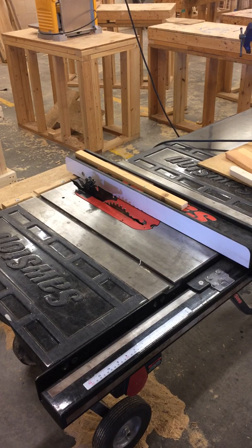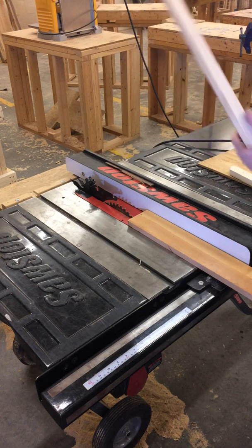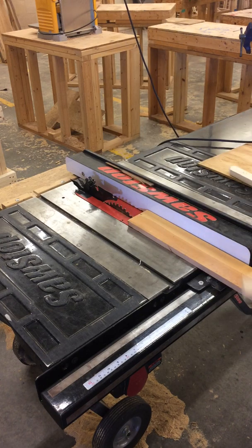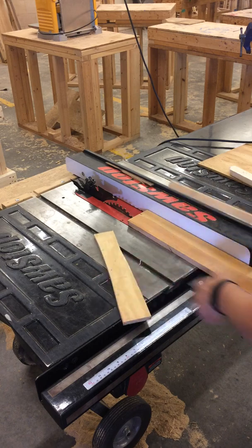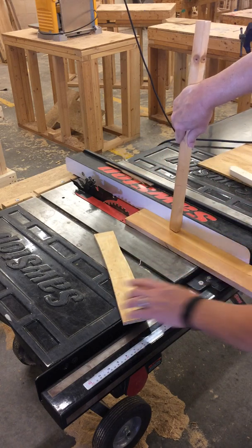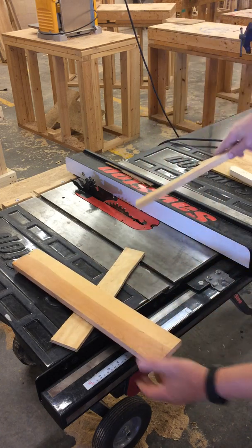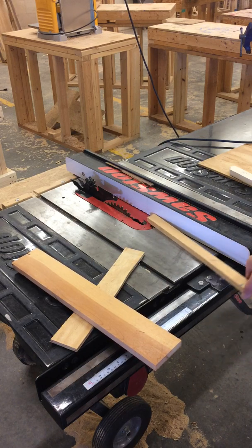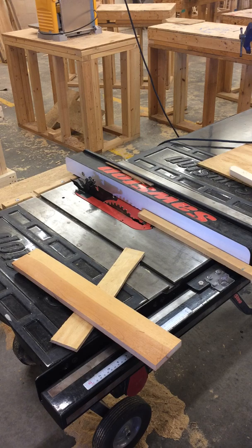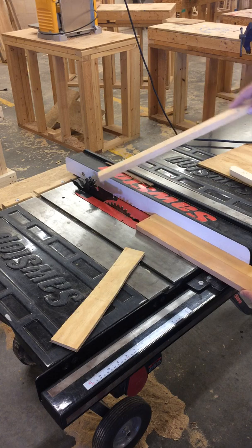Now when I get ready to cut, since I'm making such a small cut, it's within the red zone of the saw. I'm going to use a pair of push sticks — you can use any scrap you can find. They make really fancy ones, but they tend to disappear. I'm going to use a pair of push sticks almost like chopsticks, and start it with my hand, then use the push stick to hold it down and hold it toward the fence. My focal point is right here along the fence. I'm not necessarily watching the blade, because the wood will want to come off the fence at different angles and make for a crooked cut. My focus is on sliding this piece of wood right along the edge of the fence the entire time.